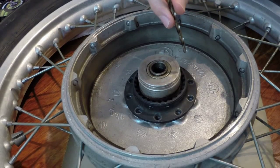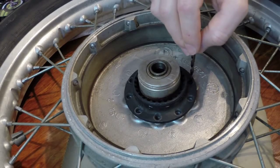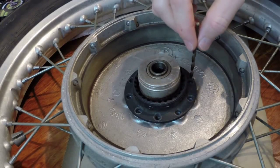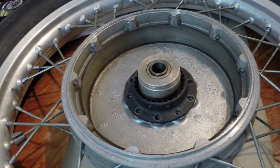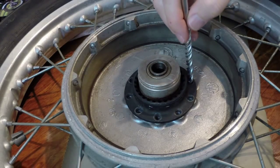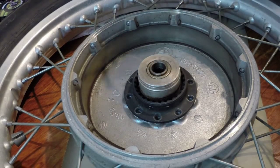Once you've gone down a half inch with the pilot hole, follow it up with a 3/16-inch bit. If your pilot hole was straight down the center of that rivet, this is very easy. This will drill out most of the top of the rivet. You don't have to go the full half inch, but you want to go down maybe a quarter of an inch or more — just enough to get below the level of that driving dog with the 3/16-inch bit. Then for the final drill bit, you want to use a masonry bit. Masonry bits are carbide tipped and will basically drill off the entire head of the rivet very easily. Drill off the rivet head all the way down until it hits the driving dog, and then the rivet should be able to come out fairly easily.